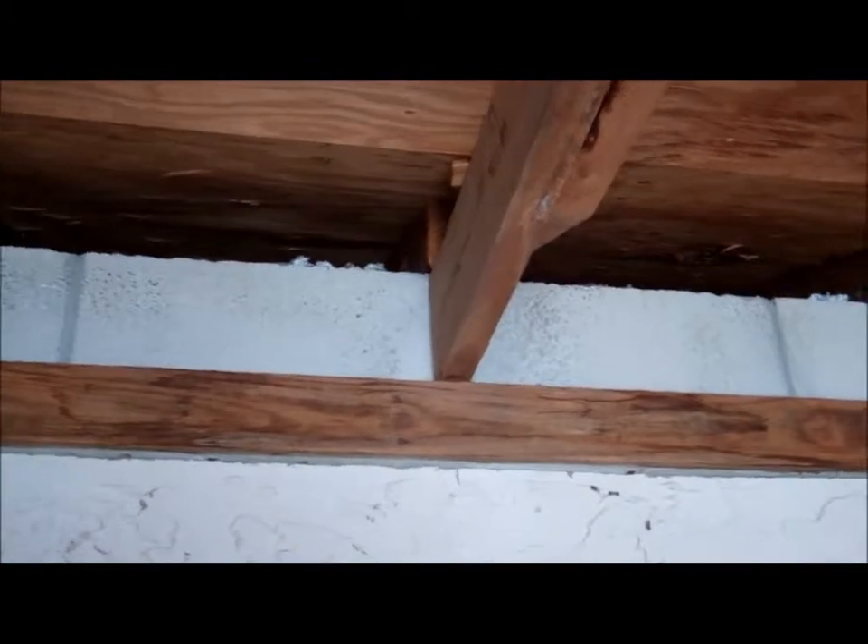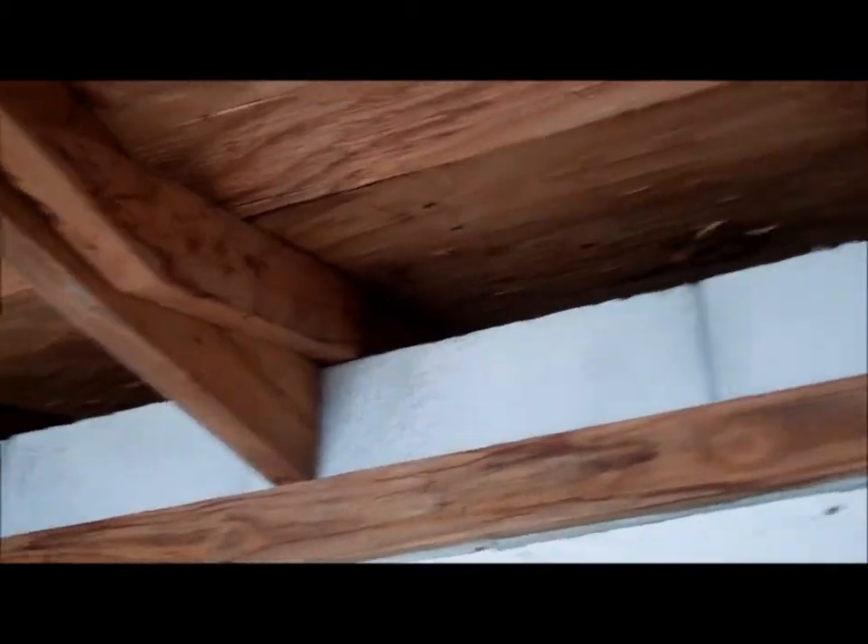But the issue we're running into in here is the roof support. Here's your rafters — they're not even bolted up to anything. There's nothing holding this; they've got one nail holding them. So this whole roof structure here is totally illegal, unsupported. You get a good wind come through, it'll probably rip this thing right up.